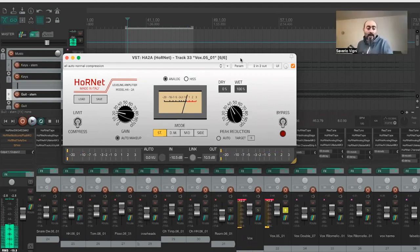Okay. So while the audio was not working really fine, we were able anyway to set the input gain so that the maximum level is at 0 VU. Of course, the output gain has been adjusted accordingly to maintain a zero dB change between the input and the output. And also the peak reduction knob set itself so that we get negative 6 dB of gain reduction. And if you listen now, it should work without crackling.